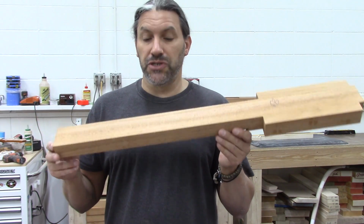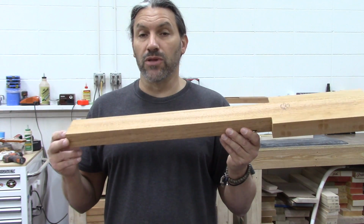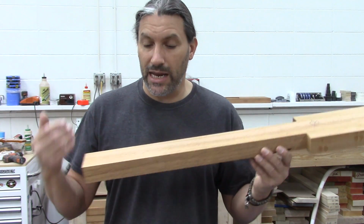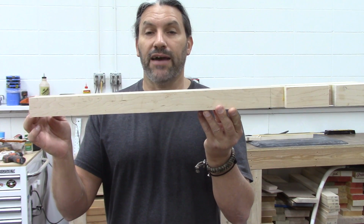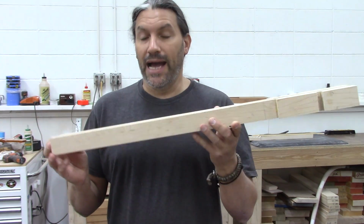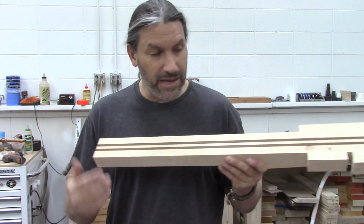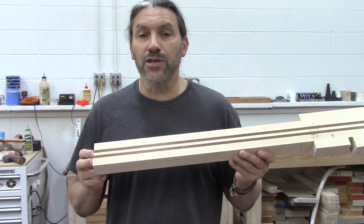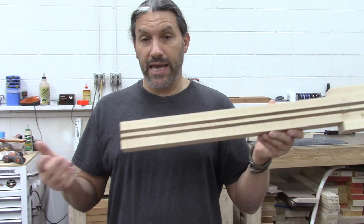So what this allows us to do is start with 8-quarter lumber, and it's very easy to locate 8-quarter lumber, and if you can get vertically oriented grain to your fretboard, happy meal for you. If not, you can absolutely do something like this guy here. It's another 1.5 inch thick neck blank. This is all maple. This is 3 pieces of standard hard rock maple, the headstock bits glued on, and 2 stringers of torrefied maple. So it might look like walnut, but it's actually all maple. So anyway, this would be cool too.